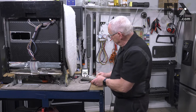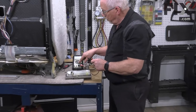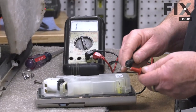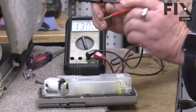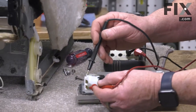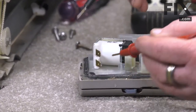To test that coil, we're just going to use our multimeter. We're going to set it on a continuity setting that gives an audible sound when we touch our leads together. If we take our leads and put them on the coil — one lead on one terminal, one lead on the other — we'll get an audible sound.